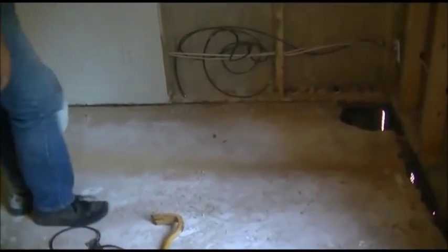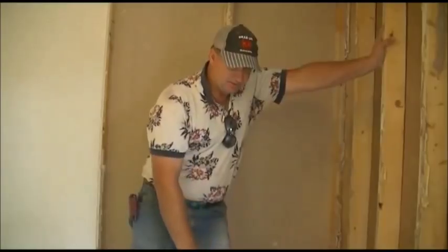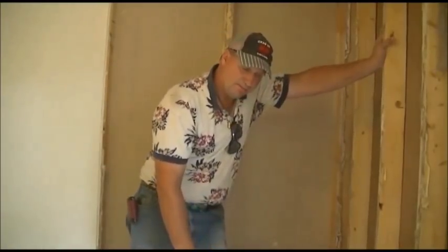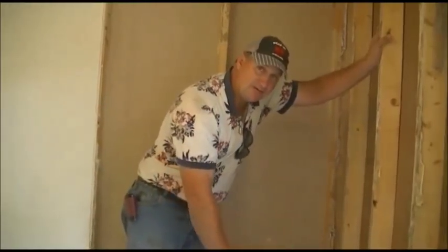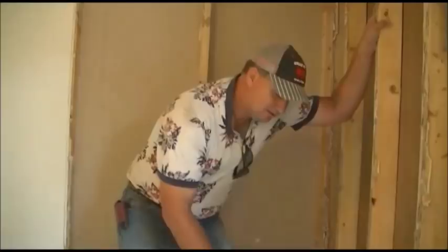Now, it was asked of me, what about water lines and electric lines? Most of that is in a sagging underbelly, which we've taken out. Now, when you have water damage that's caused by lots of water, I recommend you take out that plastic underbelly, and the insulation, because that underbelly literally holds water.